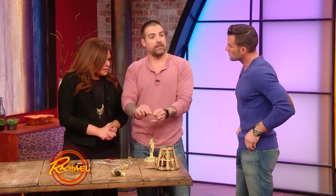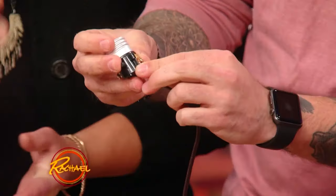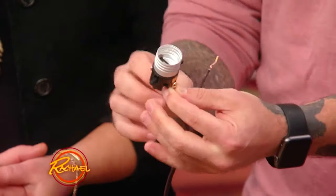What I did is I just twisted the two cables together — it makes it a little bit easier. Goes on the little screw and makes it a little easier to get it up through the neck of the lamp. One wire has a white line, the other one doesn't. You just read the packaging — one is for neutral and one is your hot lead.